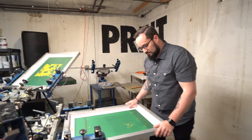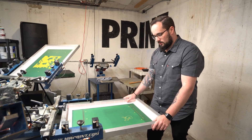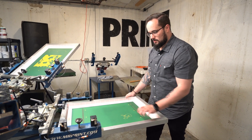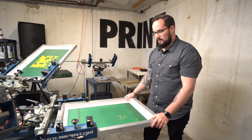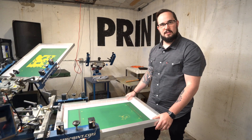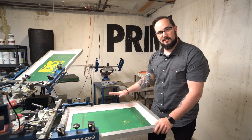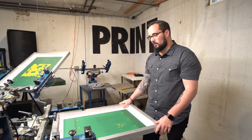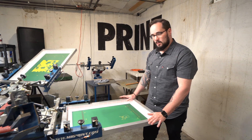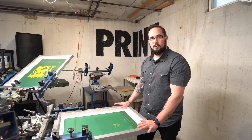Improper off contact is something you see incredibly frequently. Most shops will just keep it jacked all the way up and oversaturate by adding a bigger choke or bigger stroke and just lay down too much ink, or they'll go to their hoodies and not even think about raising the off contact — and then they get those nasty cement, stucco ceiling-looking white prints that feel disgusting. You can feel it like a topographical map. It's a massive thing that's overlooked frequently. We're definitely in the industry of variables — you have to know the variables and control them, and once you do you can really make the print do what you want.